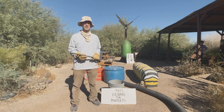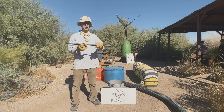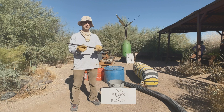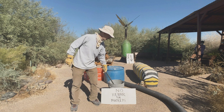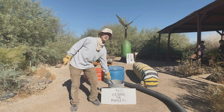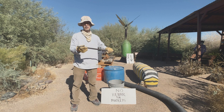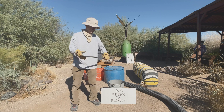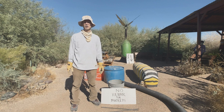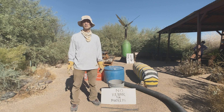There are a couple of safety hazards at the work site that are very important to pay attention to. The most lethal one is the rebar. It's possible to get impaled by the rebar if you put it in a bucket and walk with it or leave it sticking up. That's really, really bad. You can fall down and become impaled, or leave it in place and somebody else falls on it. Just put the rebar on the ground. When you have to move the rebar, drop it on the ground. The most important thing is to stand sideways and always pay attention to where you are around the trench — don't stand too close.